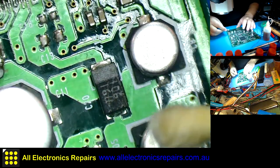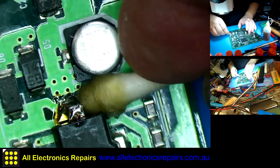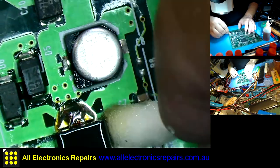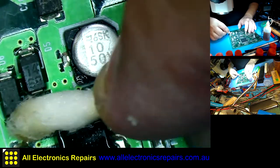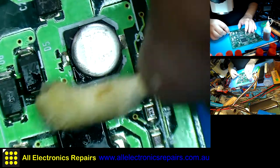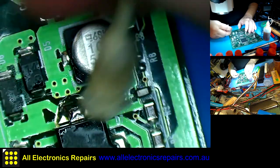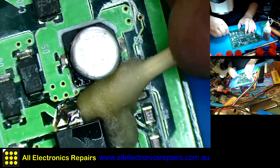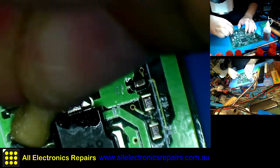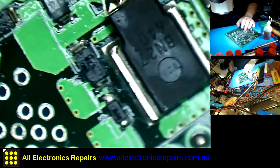And especially when the board belongs to, say, a device which works in the open air, like this forklift, with this board exposed to the elements at all times, at least how it was shown on the photos, and the state it was in with a lot of mud on it and other dirt. In such a case, I always protected by spraying the layer of protective lacquer with the flux underneath. It's not a good idea. Maybe it would still stick and form the cover, but it would look horrible. While my boards always look almost like brand new when I finish with them.